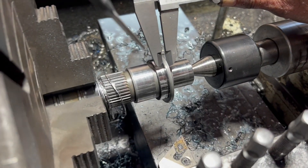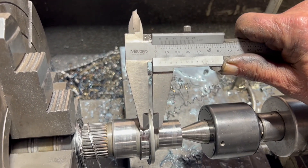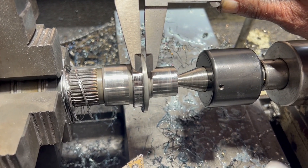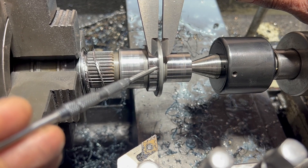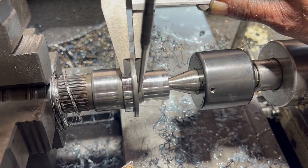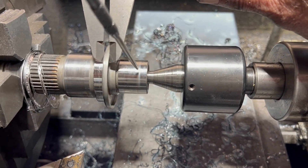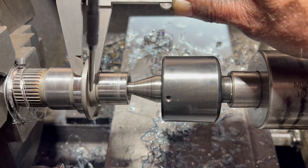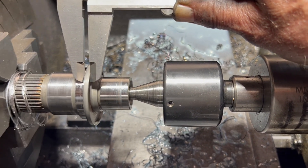We've got this surface here at 46mm OD, and the thickness that the verniers are measuring is 4mm. It's very important that you only take the material off the back of the face and not off the front face. The next part of this task is to part this off, and from the face where the thrust bearing sits out is 6mm, which we'll do now.